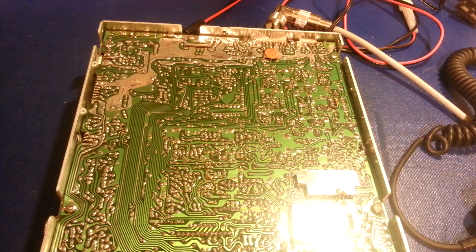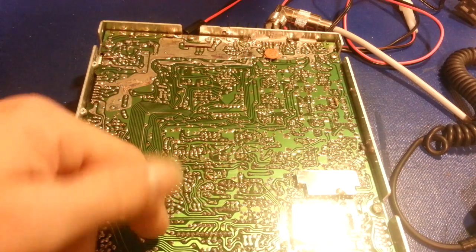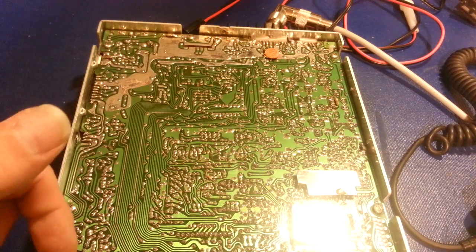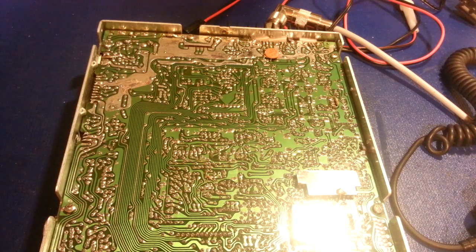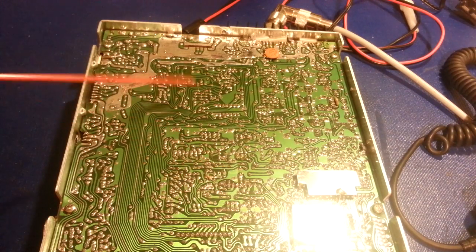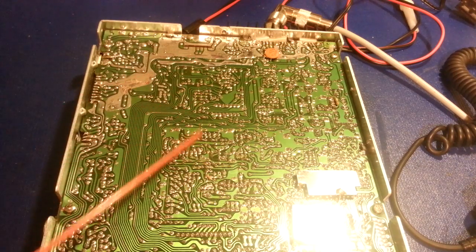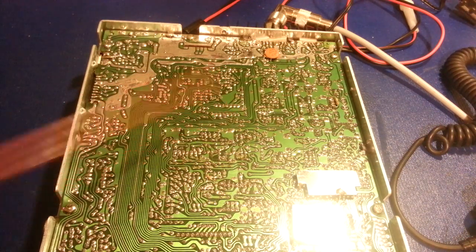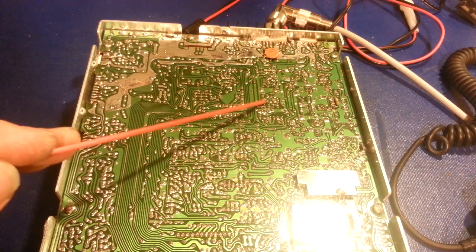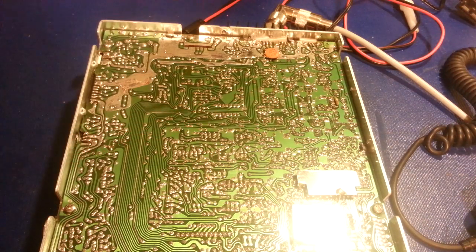Just take something plastic — you don't have to have a fancy alignment tool. Any piece of plastic will work: a screwdriver handle, a comb. If you're having intermittent receiver or transmit problems, key the microphone and just rub the plastic across the board, across the solder traces. I use little fiberglass shafts. If you've got a bad solder connection, as soon as you hit that bad connection it'll either start working or stop working. Once you've traced it down to a small area, go through and touch each individual lead until you find the bad one, then reflow the solder.